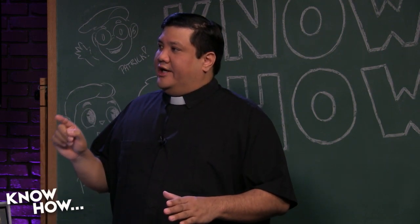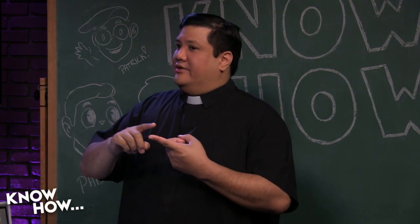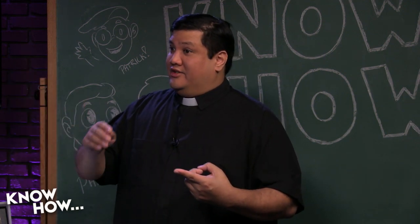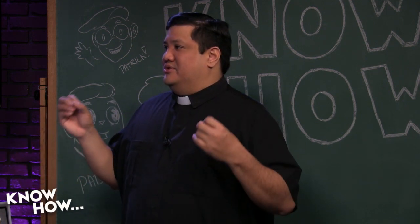Okay. Oh, but specifically, he is concerned because he can't store values. This is a very common concern when people are doing projects with Arduinos. On a Raspberry Pi, you've got a file system, so you can always save to the file system. Right. On an Arduino, when you power cycle, it clears the memory, right? Because remember, there are three types of memory in the Arduino. There's the flash, where all the instructions are kept. Your programming will stay because it's non-volatile memory. But then there's the system memory, where you would store things like variables. Right, like the variables that you want to keep. And if you power cycle, that goes away.